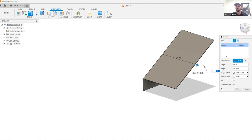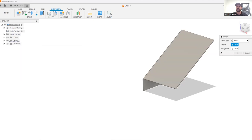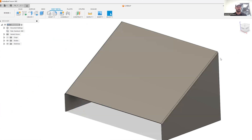When I mirror this over off of seven inches, it's going to create our overall width of 14 inches that we wanted for the width of the computer, and then the 10 inches is set off that side flange. We're going to click okay. Now I'm going to come in here, click mirror, we're going to mirror this body off of that side edge, and now we have the full overall back of the computer stand.